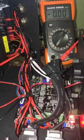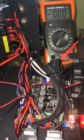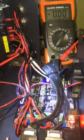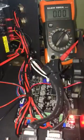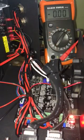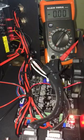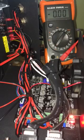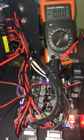So that's it, guys. Looking at the board from my angle, your first pot is your X — you want that one at 0.95 volts. The next one is Y — you want that one at 1.05. If that doesn't work well, go to 1.15. My X out of the box was like 0.2, which was quite low. The other ones were mostly around 0.8.